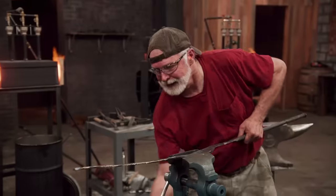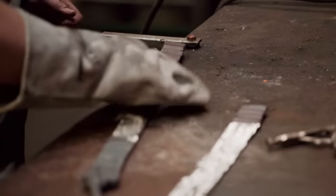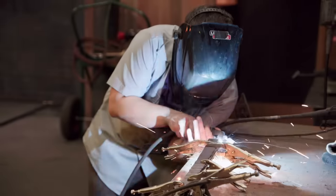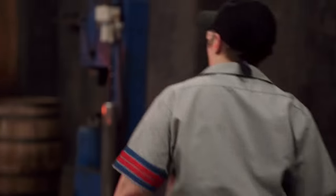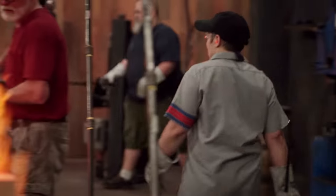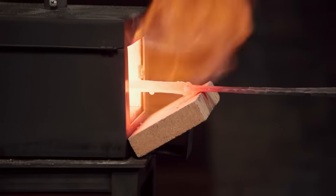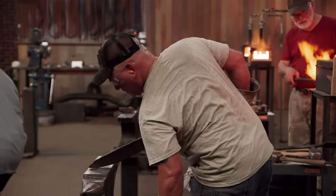It's not working. I'm not feeling good at all about it. My wrought iron and my high carbon steel have been drawn out to a sufficient length, and now it's time to start welding my billet together. Rachel's been at the welder for a while. Hopefully everything comes together real nice. San mai is a technique I really know very little about, and I really cannot wait to give this a shot. My biggest concern at this point is that the welds are not going to stick. When it comes down to forge welding, you never know until you're done.